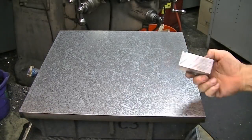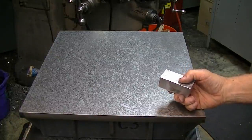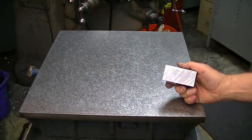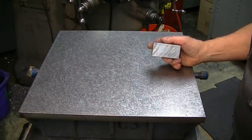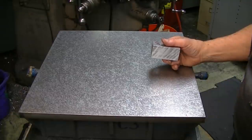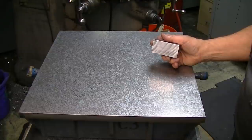Okay, now with the failure of the foil on the large lapping, I think the foil obviously works fine on small lapping, but it's just not going to work for this with the dead soft aluminum. Higher strength aluminum, thicker, would probably work just fine, but even then, for the final precision finishing I'm doing, I think the glue variations would be an issue.